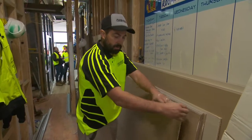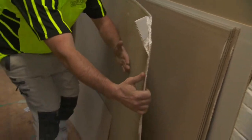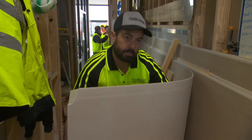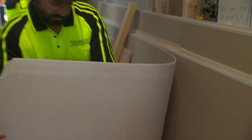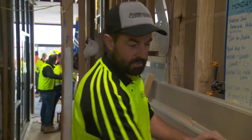As soon as you put that sharp edge against your gyprock, like on a corner for instance, it just snaps. But as soon as you put that nice soft roll into it, you can really start rolling your gyprock. Because it's a six mil gyprock you can really bend it to suit your curves, and with that MDF behind it you can really start pulling it — it just keeps coming, it wants to follow you. This stuff is brilliant, the six mil.